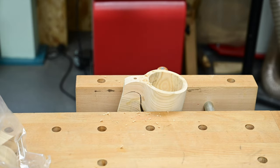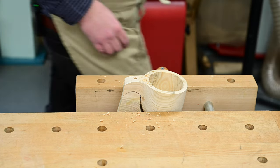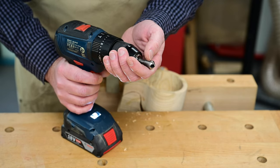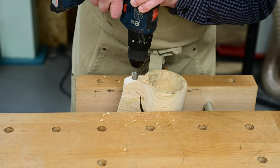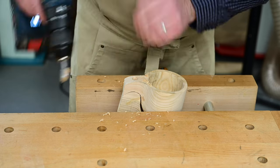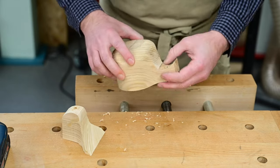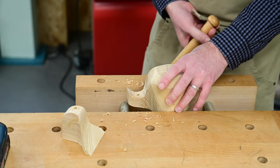And we want our little countersink. There we go. So countersinks, this is one of the snail type cutters. And just going straight in that hole. We're going to do a nice big countersink on this one, because if that's hanging on a cord, we want that cord to be able to swing so it's not getting stiff. I may struggle with access to this back one. Let's give it a go. If not, we can always take any nasty bits off by hand.